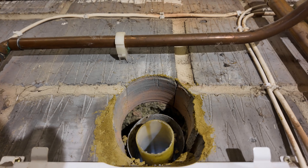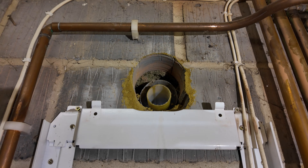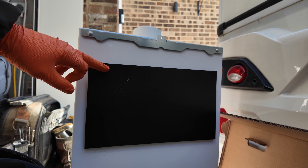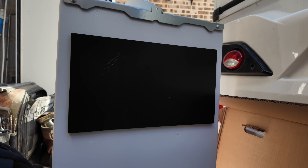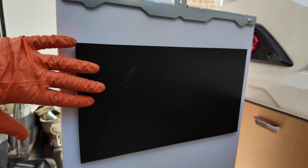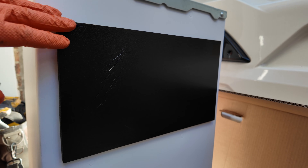The flue was nice and easy — it's just a bit of insulation shoved in there. So far so good getting it removed. Let's get this jig off and get the Viessmann on the wall. Unpacking the new boiler, on this Viessmann 100 I've noticed they've actually added a cushion on the back. The way it sits on the bracket it's almost slightly off the wall because of these little black feet on the bottom. They've added this cushion on the back now — I guess that's just to prevent any vibration going back into the wall.